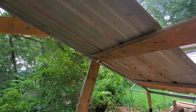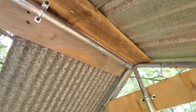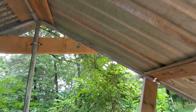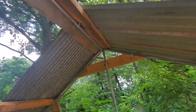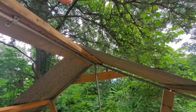The first two pieces of tin are up and in place, bolted down. Awesomeness. I can still see a little light crack — I don't have the flashing across the top yet to make sure I don't have water coming in that crack. Mostly because it's lunchtime — it's 11:30. As I put the boards up, I went ahead and put my sealant for the old holes in. You can see it looks a little bubbly — a little white bubbly — but it will dry clear. That's how I know it's dry. I figured I'd go ahead and do lunch first, give the holes on this piece an opportunity to dry, and then I'll come back and actually start attaching the upper piece of flashing to that end.